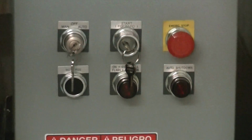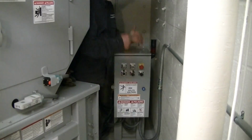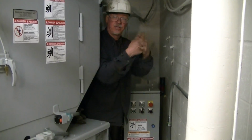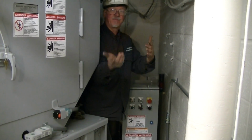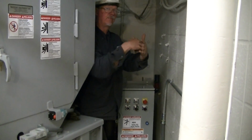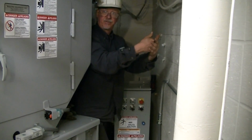What do you mean full? Which one? The dumpster, or the chute itself? When the can gets full. Oh. It's going to pack it in there. When it reaches a certain pressure, crushing that trash, it's going to start by giving you a blinking light at a certain pressure, and then when the pressure gets all the way to full, it's going to shut off and the ram will be out against the trash.